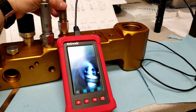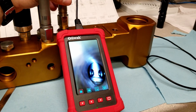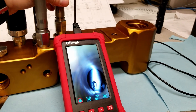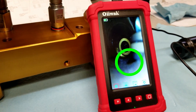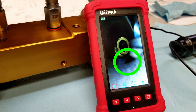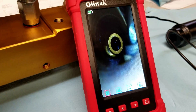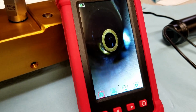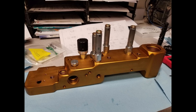So for each valve, we actually look at them, but it's at the very end when you have the crisscross holes — that's where you're going to have any cuts or issues. Especially in this one right here, where that hole is not centered on the other one, so it actually creates a really sharp edge. So we had to go in and make sure these were all slightly deburred, but not too deburred where the seal would then push out after it was trying to get in there.